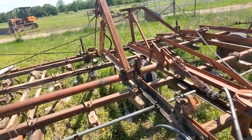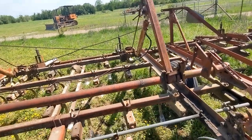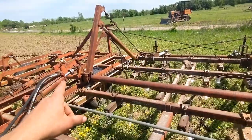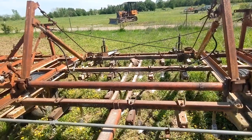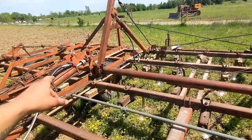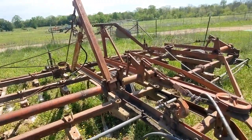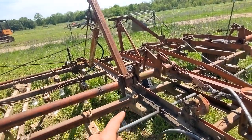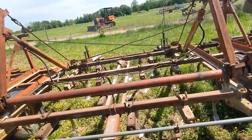But if you've ever used a tractor, you know that whenever you pick up a front end loader or this thing, they always work at the same time. That's because of this shaft right here, which is mechanically coupling those together so that if that one moves, this one has to move. Essentially, you're sharing the load between both of them. So if this one has less load on it, maybe because the ground is softer over here, so it's easier for the cylinder to pull the teeth up through the ground, and this one is heavier for whatever reason, then that coupling will connect them together, share that loading, and make them come up at the same time.